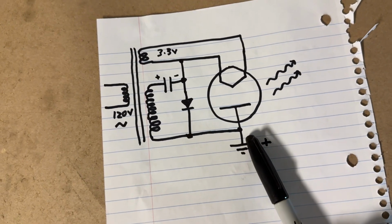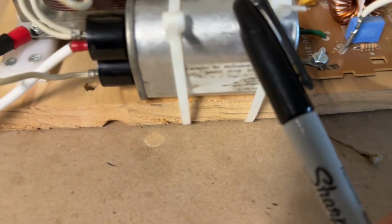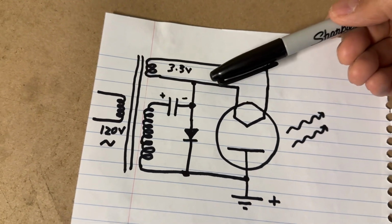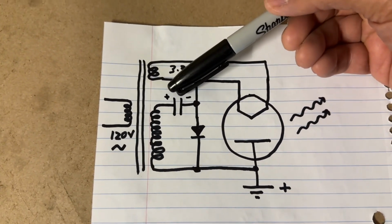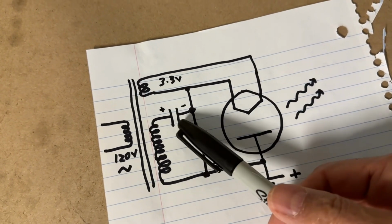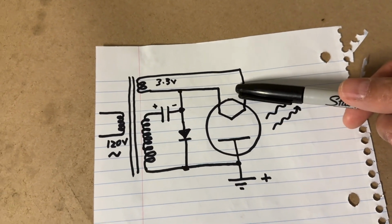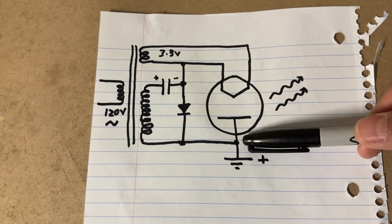And so you have a microwave oven capacitor. This one's rated for use in microwave ovens, and it is rated for peak voltages of around 4,000 volts. Because you effectively have a level shifter here, where the secondary puts out about 2,000 volts, which is stored up in this capacitor. And once this capacitor fills up, then part of the mains, which is an extra 2,000 volts, is on top of the voltage already in this capacitor, which effectively doubles the voltage across the cathode and the anode to around 4,000 volts, at the mains frequency of 60 hertz.